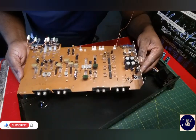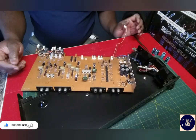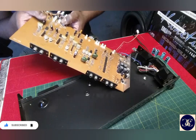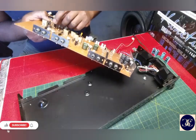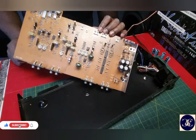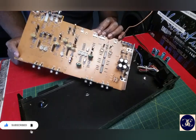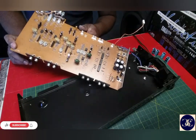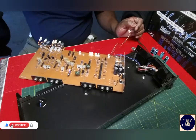Wow. So this 25 volts 10UF, these two, I'm gonna change these two to 25 volts 10UF. All right, and these up here are 50 volts 1UF. Changing these two. Oh, 25 volts 4.7UF, 50 volts 1UF. Yeah, I have all of those, so let me just go check them out, guys, and get right back to you guys. Get everything together.